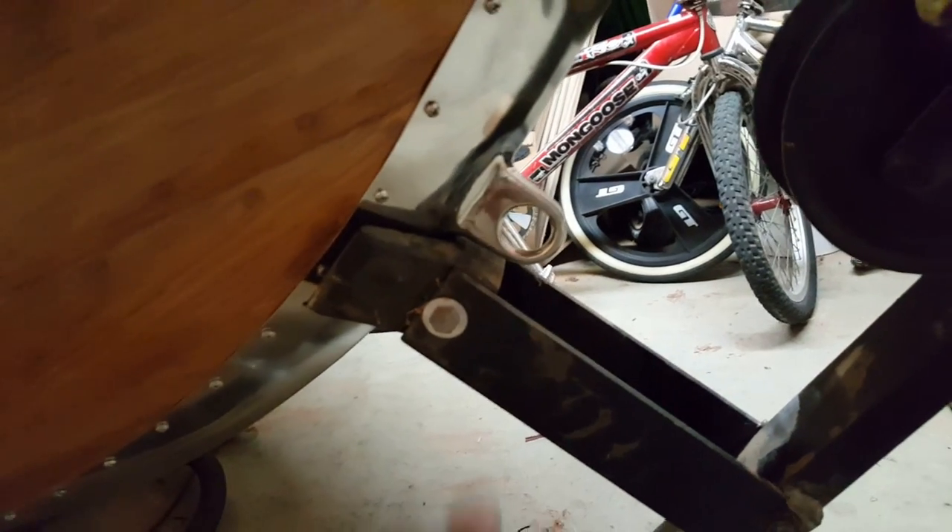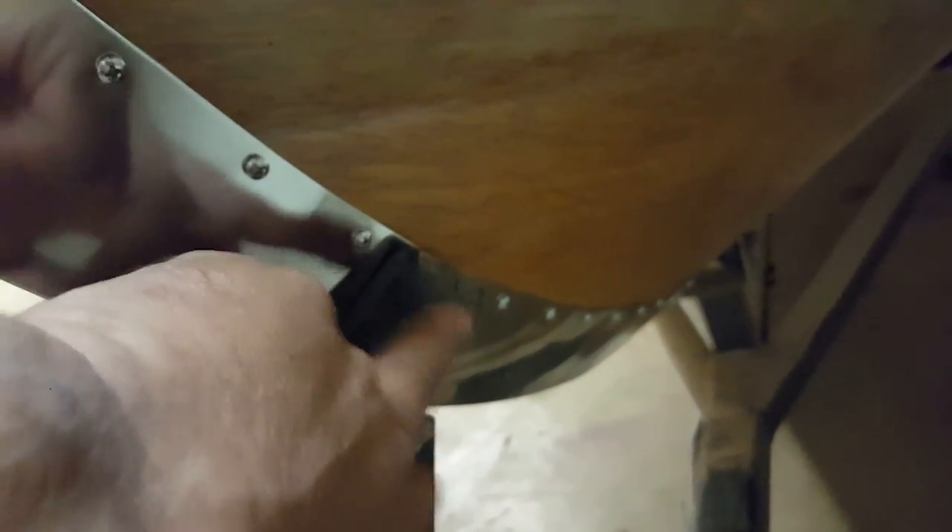Here's a look at the stainless bow eye, mostly smoothed in now and looking pretty darn good - it looks like one piece, just like I wanted. Here's the seam where the weld was - it looks fantastic. There's a little wobble on one side near the rubber stop that I couldn't finish fitting behind, so I'll get it pulled off and continue fit work, but I'm pretty darn happy with it. Still some work to do but the cut water is almost done.